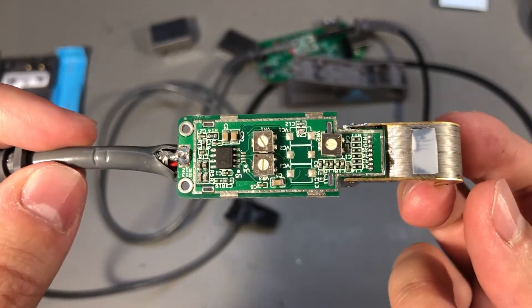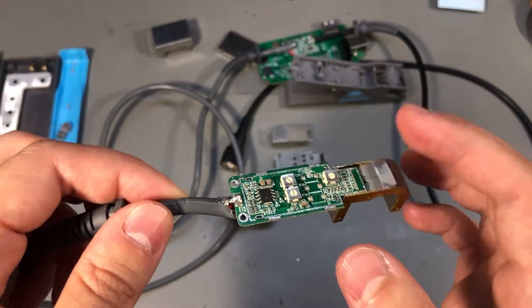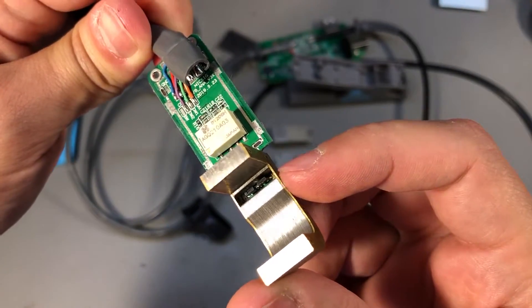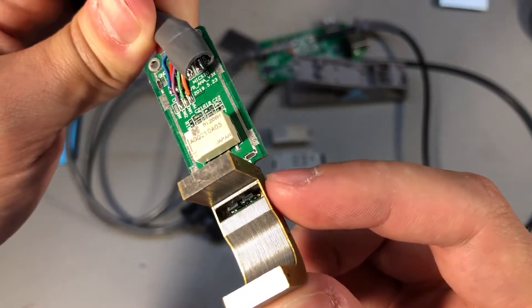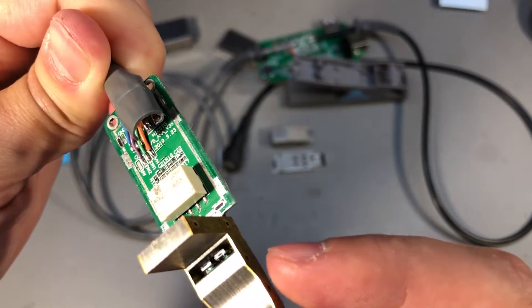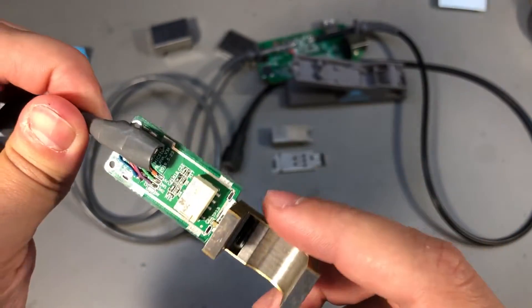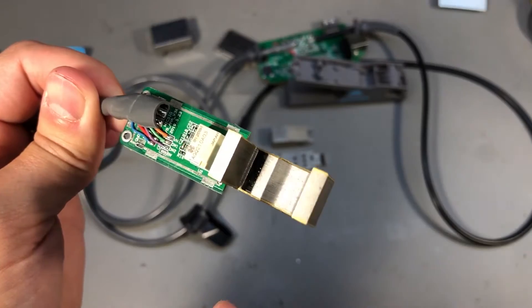We find the same build quality inside the probe — everything looks super nice and it was shielded from both sides, but I removed the shields to show what's hiding underneath. This is the part where the actual sensor sits, and I believe they're using a couple of TMR sensors here, whereas the cheap 50–60 dollar probes use Hall sensors. TMR, which stands for Tunnel Magnetoresistance Effect, has advantages over standard Hall sensors such as less temperature drift, less aging deterioration, and I believe a bandwidth advantage as well. These TMR sensors have their roots in the hard drive industry, as a lot of the technology used in magnetic read heads is very similar.